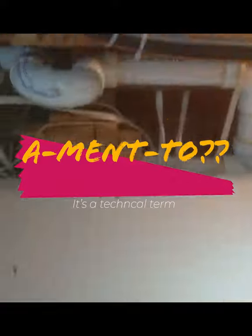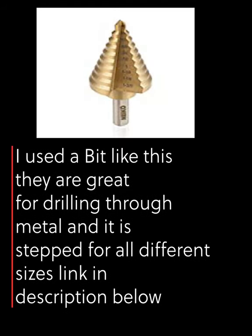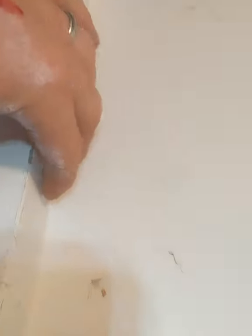We've got our hole knocked out and we're going to install our Romex connector, then fish a fish stick down and pull the wiring in. I've got my Romex connector installed. I'm going to take my fish stick — in this case there's actually a gap in the studs up there, so it's going to allow me to shove it up. It's about a one-in-a-million shot. There's a gap between the stud wall, so it's best-case scenario. We'll leave that in and fish our wire later.